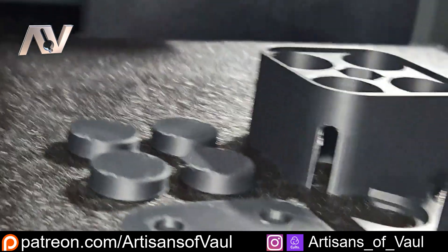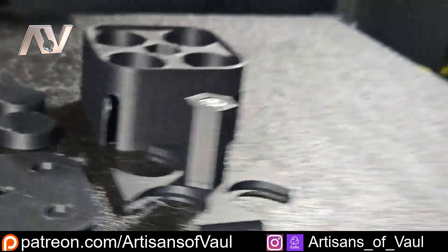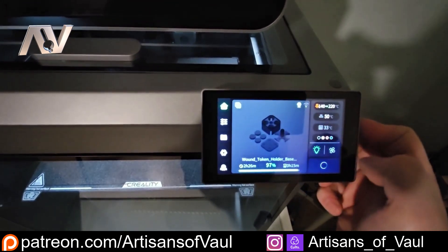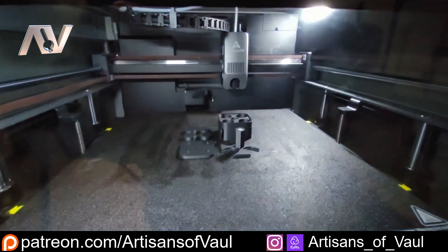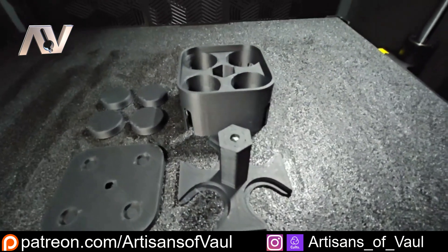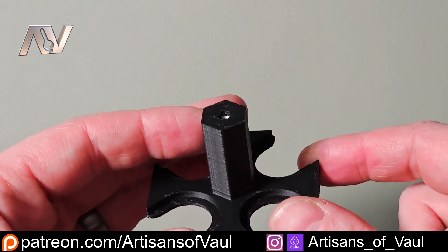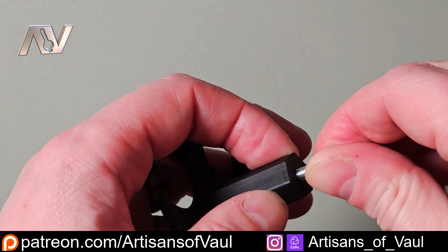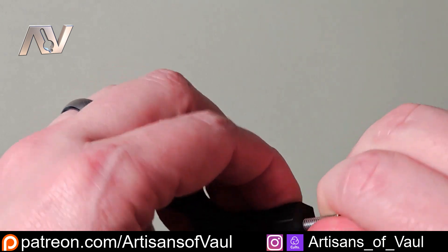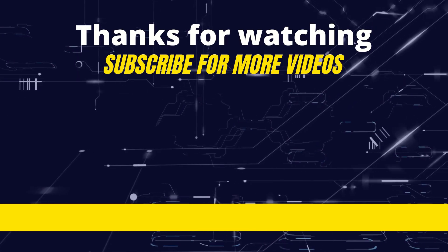At this point the printer has auto-paused. All we do is come in, add our nut to the hole, put it in, and then go back and start the print again — all available on the display. The print is now done, and you can see the nut has been embedded into that part of the print. You can see it through the hole where the screw is going to go. Everything fits really nicely — just put the screw in, and that adds all the strength needed for the 3D print assembly. It also means we can deconstruct it if we need to. I hope that was useful, have a great day.